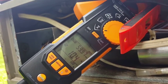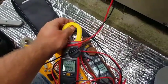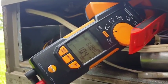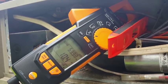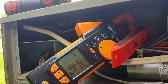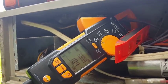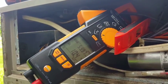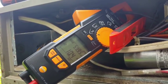Since the ACD14 Pro has the pinpoint mode, that is most likely the correct amperage — which puts the Testo really close. The farthest off would be the SC660 in broad mode (400-amp mode puts it high), and the Southwire was slightly lower at 10.3. At lower amperages, all meters were pretty close except for the Testo.